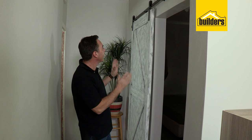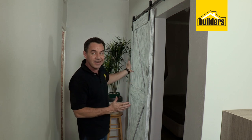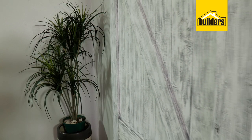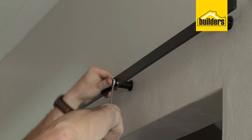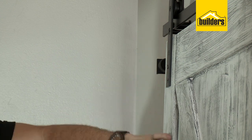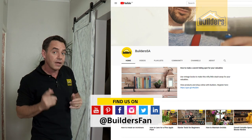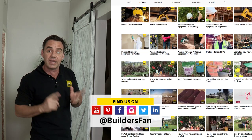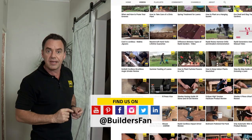Wow, this DIY has turned out awesome — I absolutely love it. This was an area which couldn't accommodate a door, and who would have thought a sliding barn door would look so good here? It's perfect, it looks great, and it's effective. You can even add a handle if you want to. We drilled a few holes at the top for the rail, attached the brackets to the door, mounted the slide guide at the bottom, and mounted the stoppers on either end of the rail — simple and easy steps. There's no reason why you can't install this yourself. Everything is available at your local Builders outlet. If you enjoyed this clip, like and share it, and subscribe to the Builders Fan YouTube channel for product reviews, how-tos, and DIYs just like this.